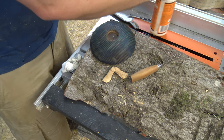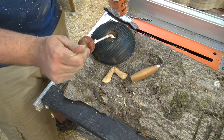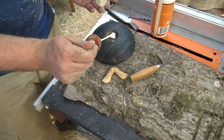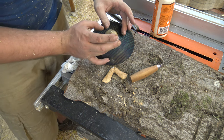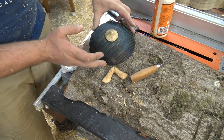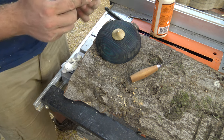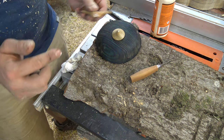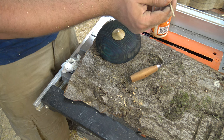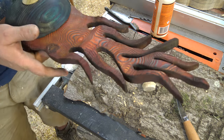We're going to put this all together now — the top lid part. Using a bit of PVA glue, Gorilla Glue or Titebond, my favourite types — really strong and long lasting. I want to orientate this so the grains match up as best I can with the existing grain. A little bit of PVA in the little hole I've drilled the same diameter as the dowel peg I've turned. We're going to let that dry and come back to it then.